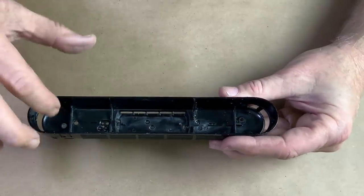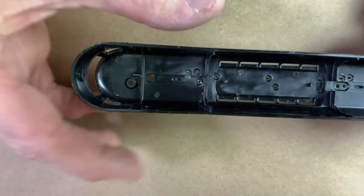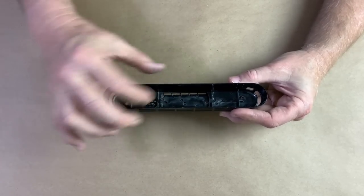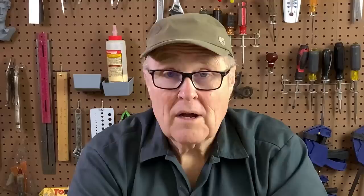And the biggest difficulty of all are these paper-thin walls. There's just nowhere to put vents and sprues for getting the resin in there, so it's going to have to be a squish mold for sure. The real difficulty is going to be holding this interior mold perfectly in alignment with the outer mold, because if it's even a little tiny bit off, you're going to have paper-thin walls over here and thick walls over there — just a mess. This has a very high probability of failure, but let's give it the old college try.